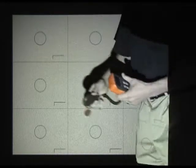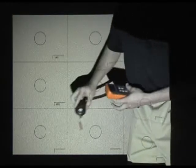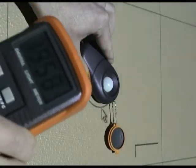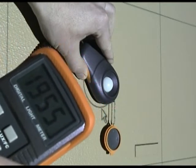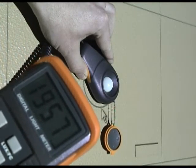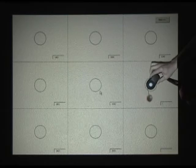Then you'll see a white screen with a checkerboard pattern. Why the Brady Bunch pattern? Well, as we'll see when we start taking measurements, the light output is a little different across the screen. To account for these variations, we take 9 measurements and average them. To take a reading, place the light sensor flat against your screen or wall in the center of each circle. Hold the sensor there for a couple of seconds and then read the number on the meter. If you see a '1' on the far left with just a decimal point, the light is too bright for that range. Type the number into the small box in Excel in the bottom right-hand corner of the square. Make sure you note what range you're in — if your meter reads 248 with the x10 icon, you're actually reading 2480. Repeat that process for the rest of the 9 squares.